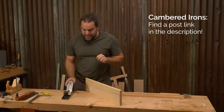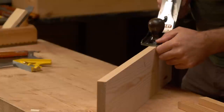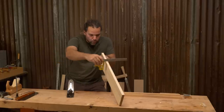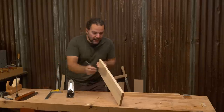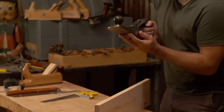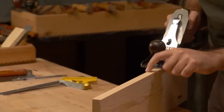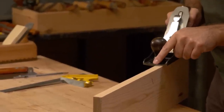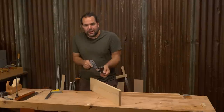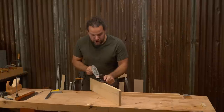So we can take that to our advantage. When it's in the vise, if I plane with the piece true to centre, using my finger as a fence as I go, it takes an even shaving. If I check with my square and we were high on this edge, in order to correct that, I wouldn't start messing with this lateral adjuster — you don't do that to get it centralised. What I'd do is walk the plane over to the edge I want to remove, because now the centre of the plane, where it cuts deepest, is over the high spot. You basically manipulate the squareness that way, rather than trying to twist or lean the plane. You can do it subtly just by where you position from centre.